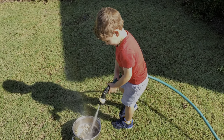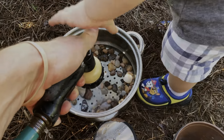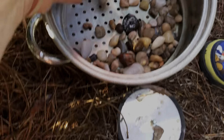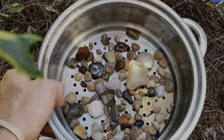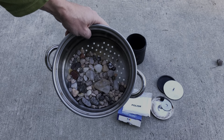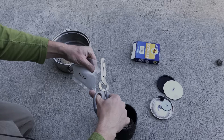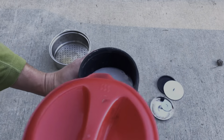Can I rinse them off? Sure. They're looking nice. One more week of polish and then they'll be all done. Pretty cool, huh? So we've done seven days of coarse grit, ten days of fine grit, seven days of pre-polish, and now the final step — seven days of polish. We've got the polish and let's pour the water into the top layer. There we go.